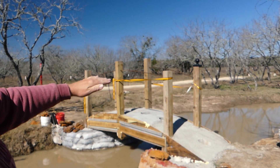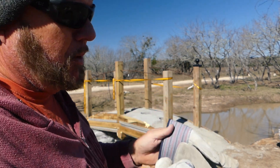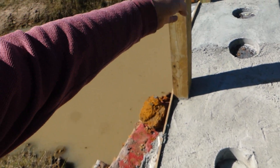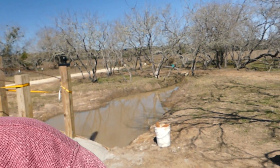The bridge I wanted to last a thousand years and it'll get foot traffic, but a roof doesn't get foot traffic — a roof will just be more static. In each spot of the bridge you'll notice circles to test the wearability of lightweight concrete. Half the holes will be filled with various formulas of styrofoam concrete, half with perlite. I've kind of already decided against perlite — not because it's not technically superior, it is, and it reflects heat which I'd like — but simply I don't have a perlite mine around here so it's very expensive. Styrofoam I can still get for free.